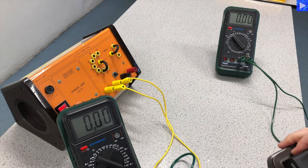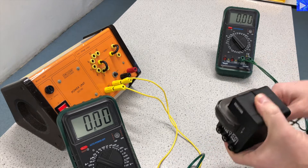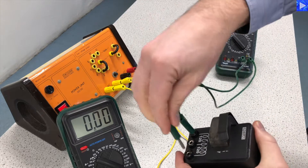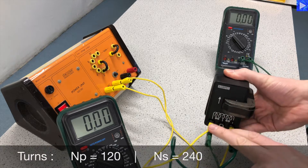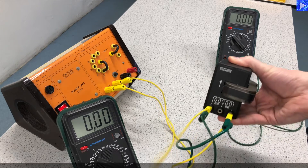Now 120 to 240. The only way to make 240 is to use both 120-turn coils. I'll turn this around — that's my secondary now — so 120 primary, 240 secondary.